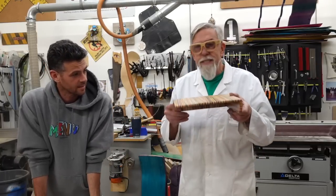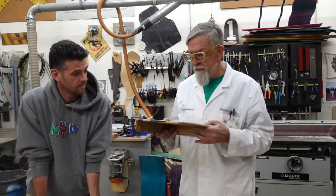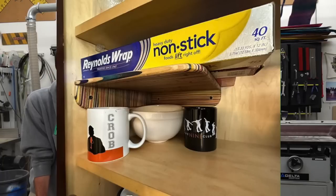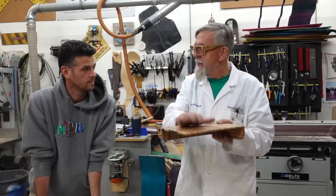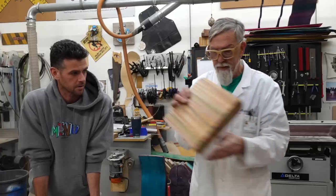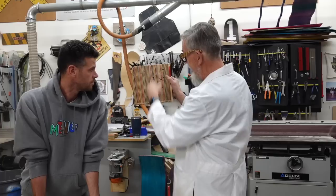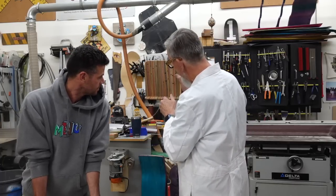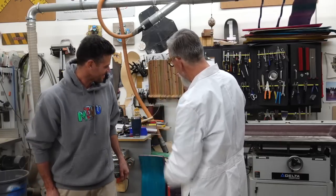So there it is. Here's just a really simple little shelf, and this is just going to go in a corner and hold some stuff — put a couple screws in here and here, a couple of drywall anchors if it's a drywall wall. Into drywall with drywall anchors you could easily get 20 pounds on there. Also notice I put the grain orientation here to make that visual come through. Just by chance, look at the purple and pink line right here — they're lining up just about perfect. However, it's only right there; over here it gets worse and falls away.